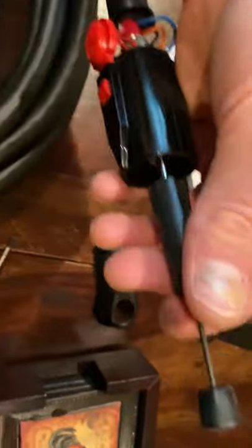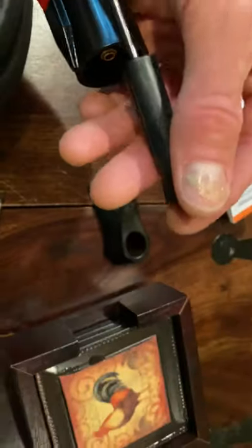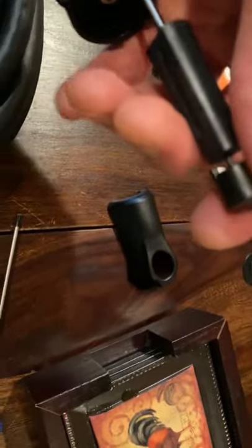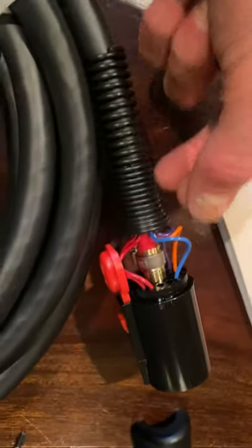Put it on the number six port as far as you can go. The plunger will be back like this — keep it nice and straight and steady, then push down on the plunger. It takes a lot of force, which scared me because I thought I'd break this little piece, but it did work. It did take quite a push and it'll pop out the back side, then you can just pull it out.